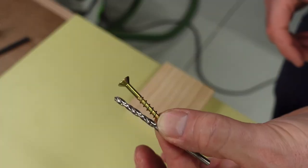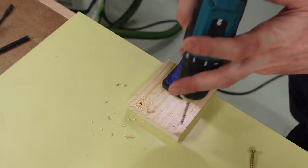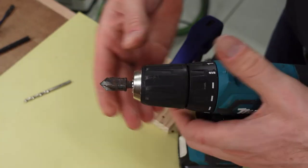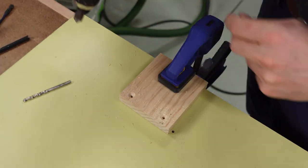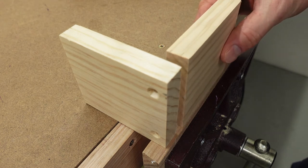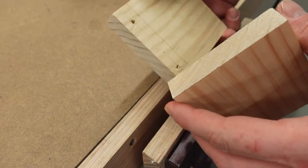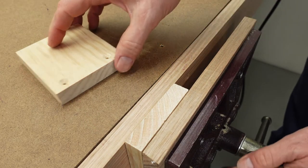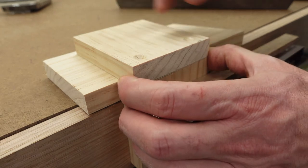It's not mission critical to get this absolutely perfect. It's one of those joining methods that can be done very quickly if need be, or if you're not too fussy about how it all looks in the end. One of the few things I'd actually use a nail for is to mark the centres for drilling, in the absence of a nail punch of course. I prefer to minimise the use of nails in a school workshop, which is a topic for another video. Next, drill two clearance holes for the screws to pass through — a 4mm drill bit will do nicely. So that I don't drill into the benchtop unnecessarily, I'll use a piece of old melamine as a sacrificial drilling board. And you end up with two nice clean holes. Swap out the drill bit for a countersinking bit and countersink each hole to take a 10 gauge screw. This can take a bit of trial and error — you can use the head of the screw to measure how much more you need to drill before the head fits neatly into the countersink. Handling these small pieces can be a bit of a juggle, so it's best to use holding devices like a clamp or a vise. You can also raise the timber up out of the vise a bit and use a supporting piece to give you better vision of what's going on.